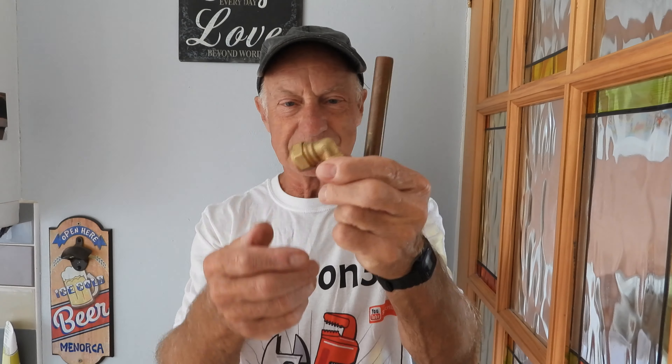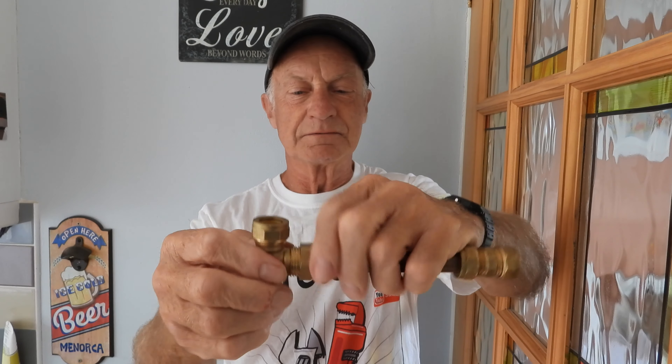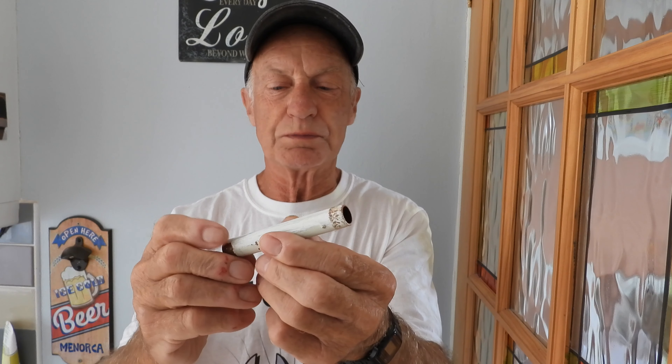Let's go with nothing at all first. That would be when you have a fairly new piece of pipe — there's no damage to it, it's clean. If you've got a nice shiny bit of pipe you've just bought, brand new, you don't need to do a thing. Just get the fitting in, put the olive on, put it on, and tighten it up. 99% of the time when it's new, fresh pipe in decent condition, you can do it up and you won't get a leak.